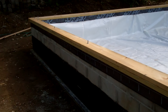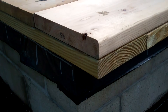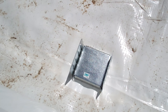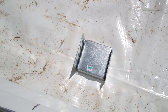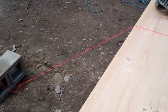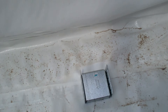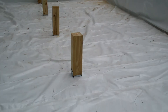I was really pleased with the way the sill plate actually did come out in the end. It's a pressure treated sill plate on the bottom and then it continues right on top. I have lap joint corners to make it even stronger — none of the seams line up and it's nice and square. This base plate is for the posts, directly over those footers that I had put in earlier. Now that the posts are going to go down there, I actually could seal underneath that with some more adhesive so that the air boundary is still intact. I pulled a string nice and tight across the top of the sill plate from one side to the other in order to get a measurement for how tall to cut the post, which is going to hold the girder up in the middle of the foundation. And now we've got all the posts in place ready for the girder.